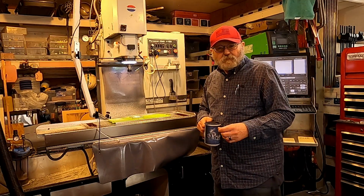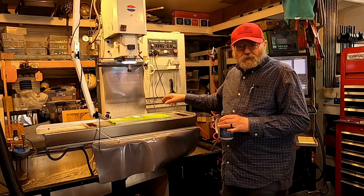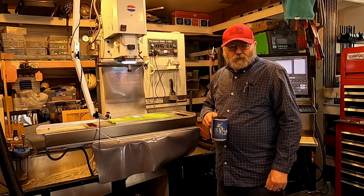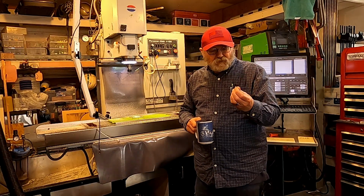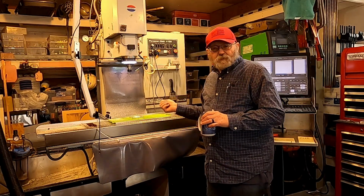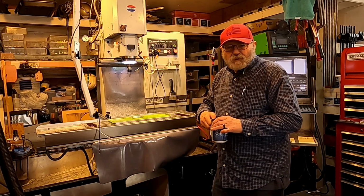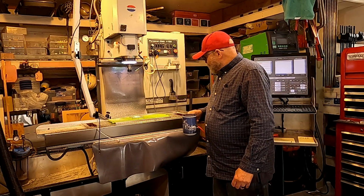And so even though I use the same end mills, quarter inch, eighth inch, 16th inch, and 1 millimeter, the stuff that was cut with 1 millimeter was almost none. At any rate, I'm about 90% done with it. I've got to chamfer some holes, he wants a flathead stainless hex screw, so I've got to chamfer some holes for that and drill the holes, and then I'll be done on the milling machine. I may throw it in the vibratory tumbler deburring machine. I've got one of those big vibratory tumblers, and I haven't decided whether to do that.